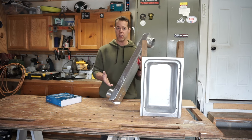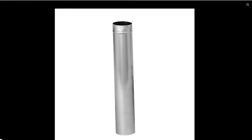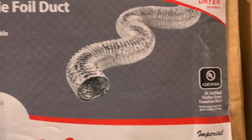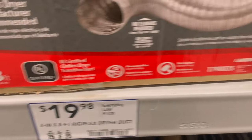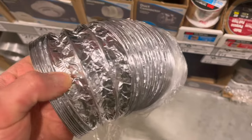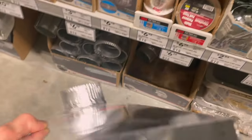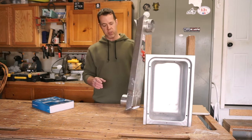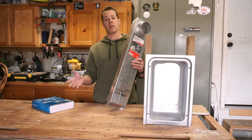The big question with these is: is it up to code? Ideally, all ductwork would be round smooth metal. A lot of people trying to save space use flexible ribbed dryer ducts, but the ridges collect lint and can lead to dryer fires. This periscoping vent is not round but it is metal and smooth, so installed properly I feel it's better than flexible ductwork you smash behind the dryer and never clean out. If you're an HVAC pro with a different opinion, I'd love to hear from you in the comments.